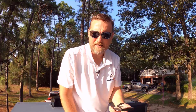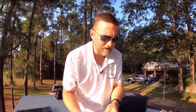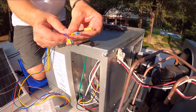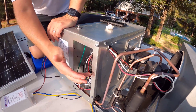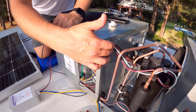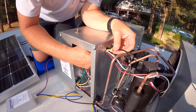The first thing that you need to do — or it's a good idea — is to go ahead and print the instructions. I took a picture of them on my phone, so you'll see me referring to this. Step one of this process is that I need to take the blue, yellow, and black wires from the soft start and run them into the area where the run capacitor is, which is going to be right through this area here. I went ahead before I started the project and put on the end terminals. I've already taken the side panel off to where the run capacitor is.